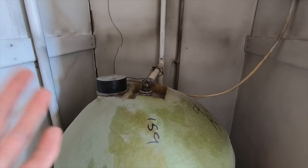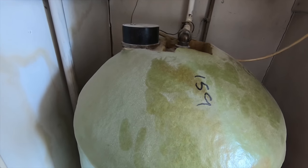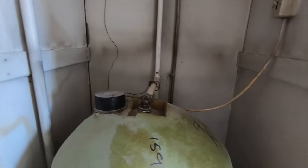Not a lot of people know that. They know where the cold water stopcock is in the kitchen, but they don't really know how to work on the hot water. So you'll need that valve up there — isolate that, drain your taps, and you'll be fine. Because you won't have to drain the tanks up in the loft.